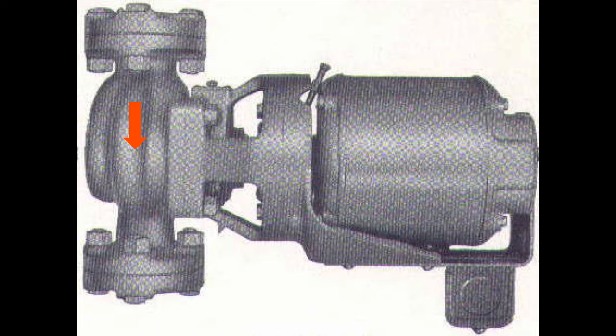And they're all installed on the return side because it makes the packaging easier. If the circulator's down at the bottom, the box can be shorter. You can get more of them stacked in a warehouse. You can get more of them on a truck. So again, habit and packaging kick in, and this is why circulators are on the return. But from this point on, there's really no reason to have them there.